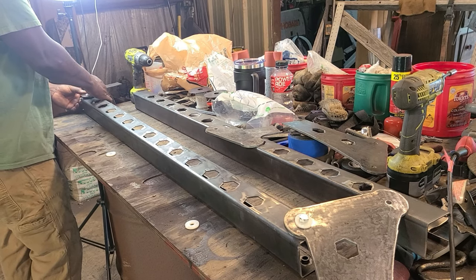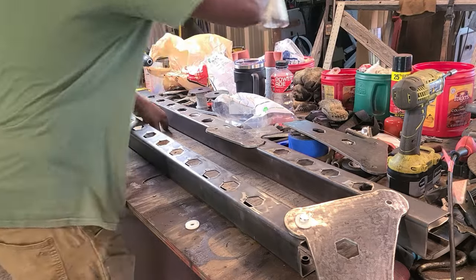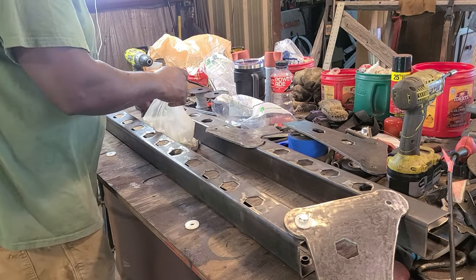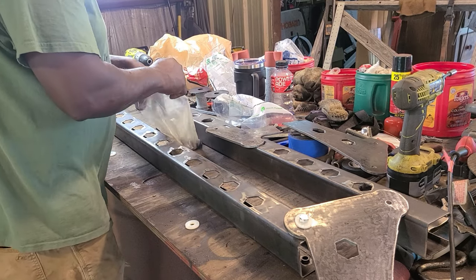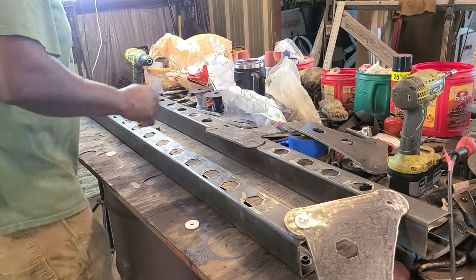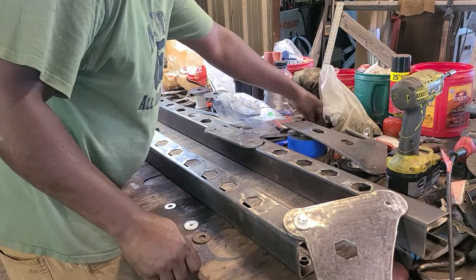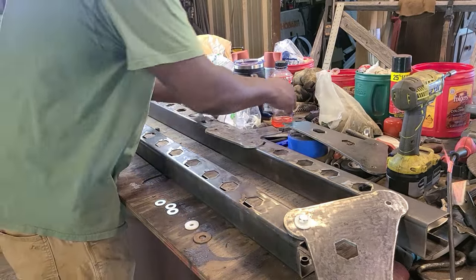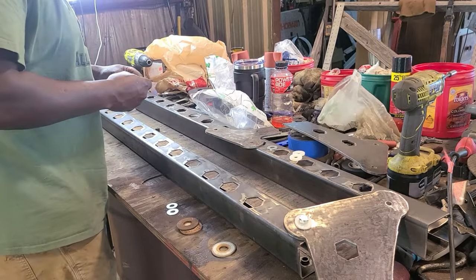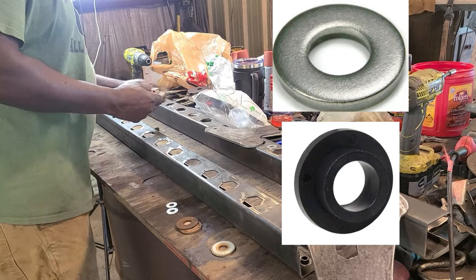You see me getting the bolts prepared and setting everything up so I can bolt these on. Once I bolt these on, I'm using nylon nuts as locking nuts. I want to be able to put as much or as little tension as I want to make sure they're stiff but not too stiff to where they cannot rotate. I'm also using a half-inch flat washer because the nylon flange washer sticks out, leaving a space — so the half-inch flat washer takes up that space so there is no play. Now I'm tightening them up so they're snug.